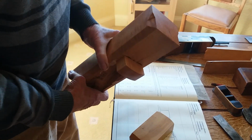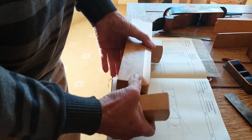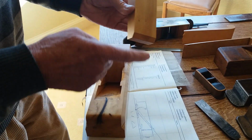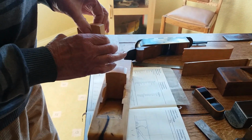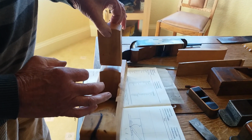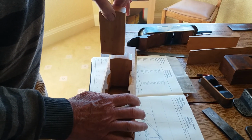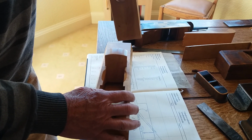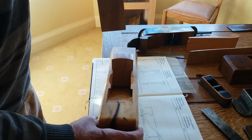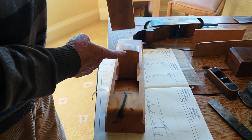This is one I made, as you know, Daddy, but I've got a spare piece of wood to explain the bottom of the mouth closure. This piece of wood has to fit the plane snugly in its width. I've noticed on a lot of mitre planes made in this country, the bodies are always beech and the mouth closure is, generally speaking, boxwood. So there's variation in the movement. The original mitre planes had beech there, but it didn't wear so well, so they soon replaced it by boxwood.